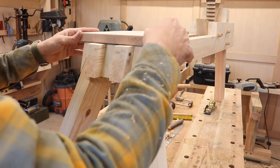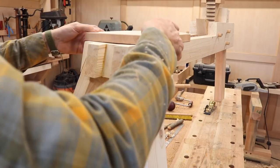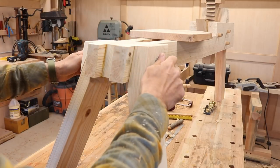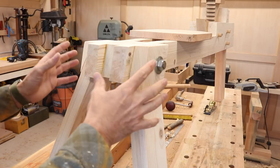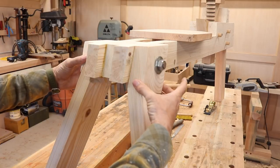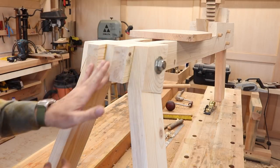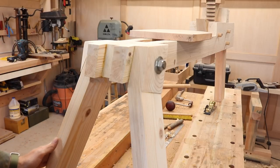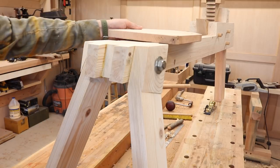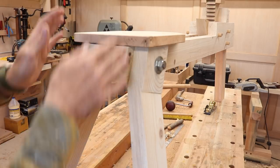When I put this together and had everything planed, it was so good. I spent so much time on it and now it's drying and twisting, but that's the way it is. I was hoping not to use any big hardware like this, but I just had no choice — the glue wasn't setting up, it was twisting on me. There are a lot of joint fittings going in here to bring all of this together, but it looks okay. I used a 5/8 bolt to pull everything in, and I wanted the back end to all kind of match up and line up and have that cool look — I'm pretty happy with that.